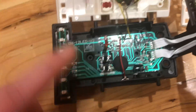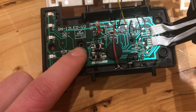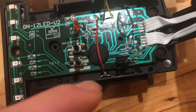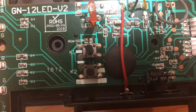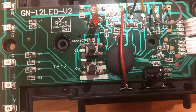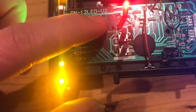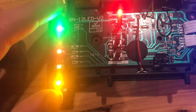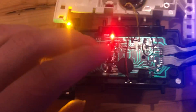Once you get in here, if you want to enable the non-stop blink so that it will never shut off, you just have to cross those two contacts right there that are labeled non-stop when you boot it up. So when you give the computer board power at first, if those contacts there are shorted, it's going to continue doing this light sequence indefinitely for as long as it has power.